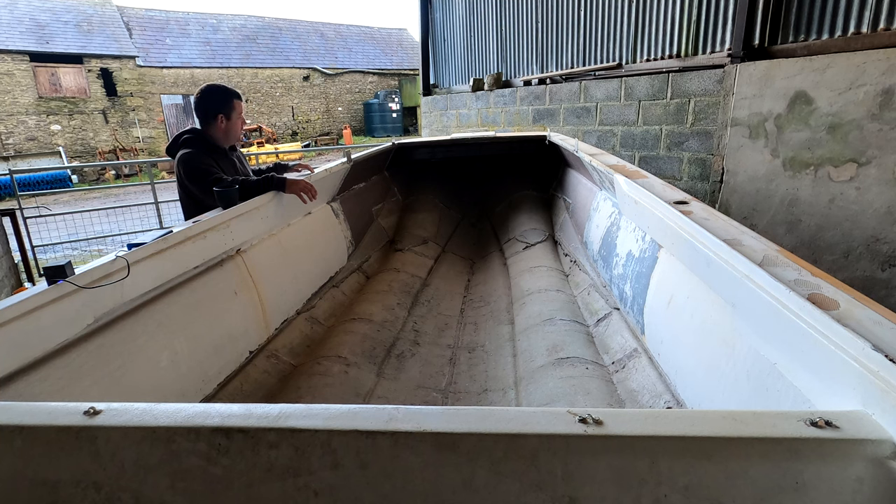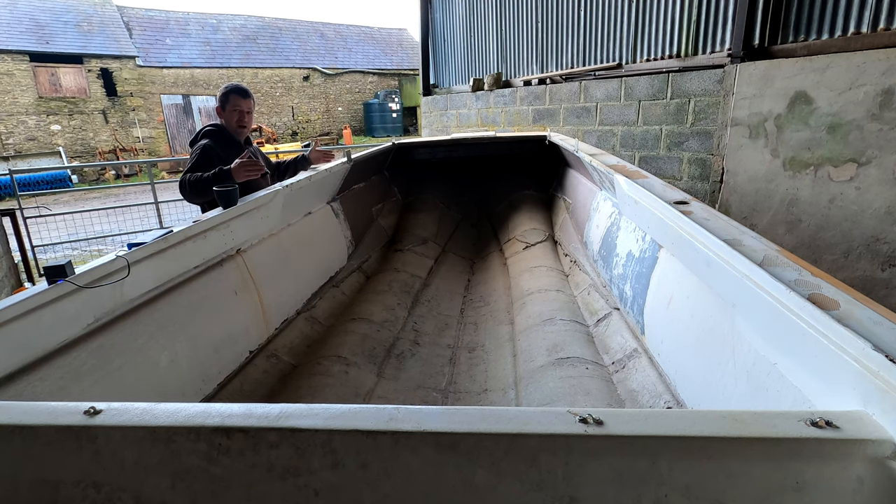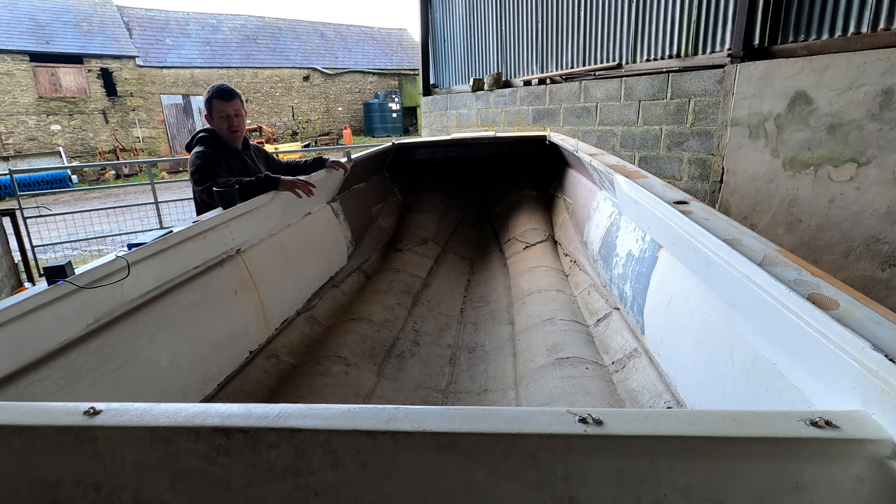It's a Pilot 520. Around the sides you've got checker plate in the gel coat — it's anti-slip. I cannot get the paint out of it. Someone's painted over it and it's probably a mil or two thick. The problem is, even if I do get the paint out, how do I rough it up properly? The paint will just flake off again. So I'm sanding it absolutely flat. There are anti-slip pads online — 3M adhesive — so the plan will be a pad here, a pad there, and two square pads up the front for walking to the anchor.